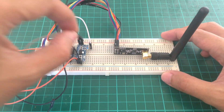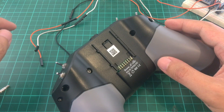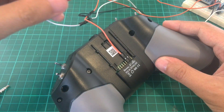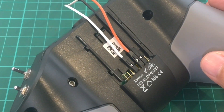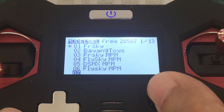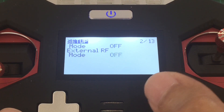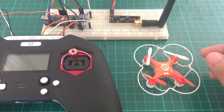And finally, connect the PPM signal. Let's connect our module to the transmitter — this is ground and finally the PPM. Next, we'll create a new model, then turn off the internal RF and set the external RF to PPM. Okay, so now we're ready.